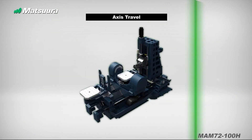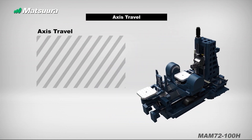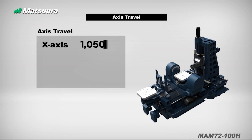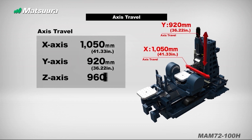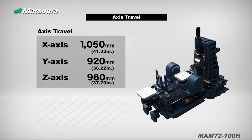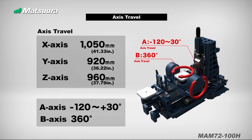When you're talking about dimensions that big from one side to the other, we're talking tenths, microns of accuracy. It's super accurate. We've made parts that are really quite accurate using the entire volumetric size of the machine and been within two-tenths accuracy of location — about half a thousandth or a thousandth true position. That's super quality.